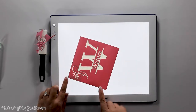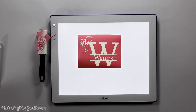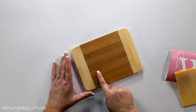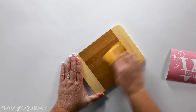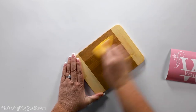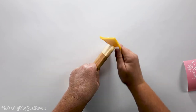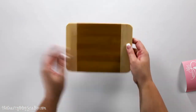Our stencil is almost all ready to go — I'm just going to trim the bottom part a little bit. The first thing we want to do is figure out which side we want that personalization on. I like to choose the best side; to me that looks like the better side because it has fewer connection spots. Then we're going to take 220 grit sandpaper and go over the area we're going to burn to make sure it is nice and smooth, and also around the edges because on these cutting boards the edges are just a little bit rough. Our cutting board is now nice and smooth.